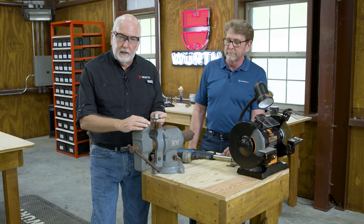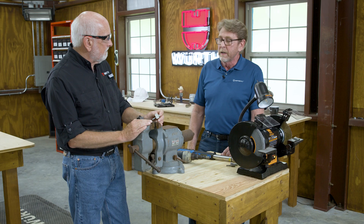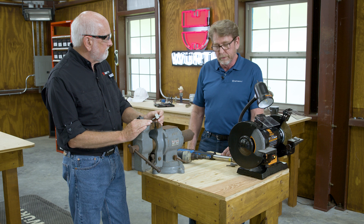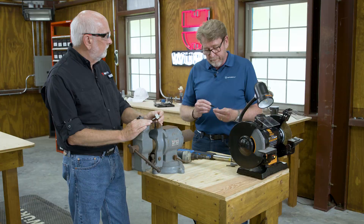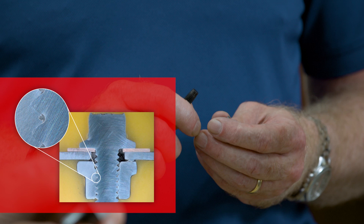What we have here in the vise are unthreaded weld nuts — these are unthreaded weld nuts used out there in industry. We see them all over the industries we're in. We especially see quite a lot of this even in electric vehicles. Because of electric vehicles, we need to have some kind of grounding quite often. When you're going into one of these unthreaded nut members, even if it has a plating or finish for corrosion, it will remove that as it goes in and it becomes a hand-and-glove fit metal-to-metal contact — it's a true ground every time. We have a lot of customers manufacturing electrical products — electric lawnmowers, electric vehicles, other electrical equipment.